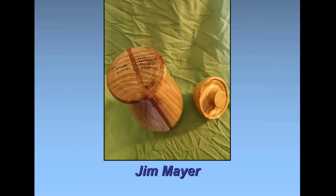Just want to mention: those PVC pipe fittings, if you buy the wrong kind, have tapered threads and they don't work that well. Make sure you get the kind with straight threads. If you re-tap it and run the thread all the way down beyond the die, you can make a machine thread out of it — you take the taper out. That works great with brass too.